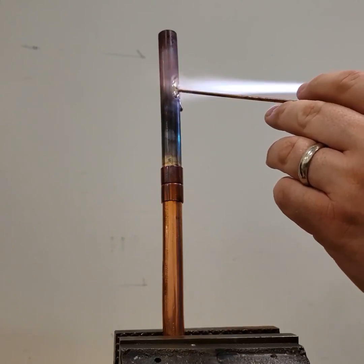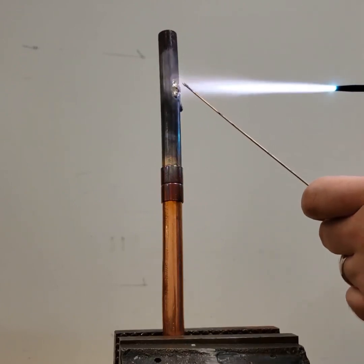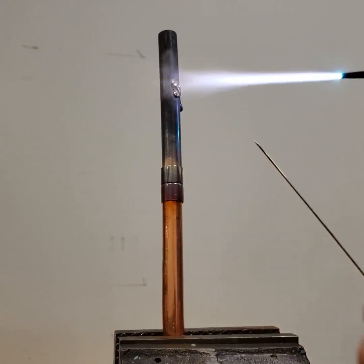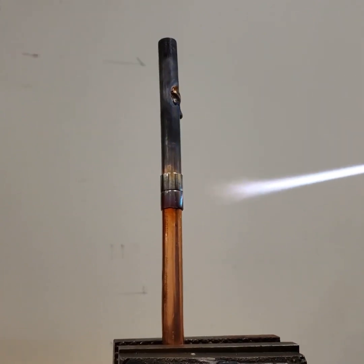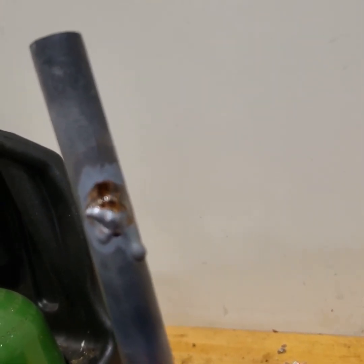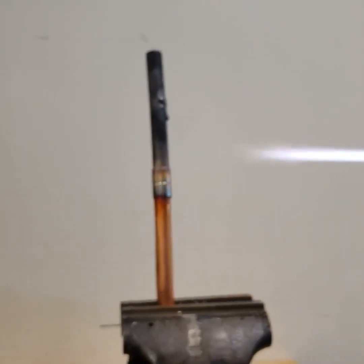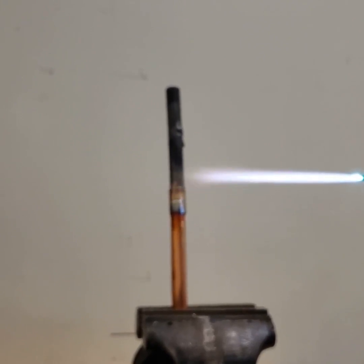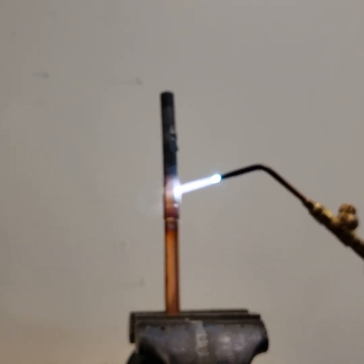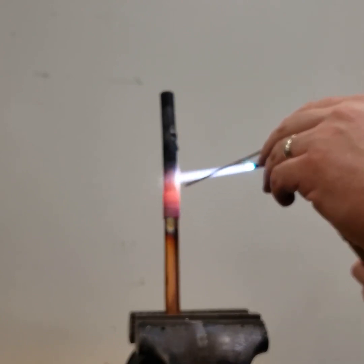It started to get a little warmer than I needed, so I'm moving the torch away. I'm trying to get right at the temperature where the braze will melt. When you were soldering you probably found it was difficult to fill large holes with solder; braze on the other hand can actually fill larger holes. You'll notice the metal is discoloring because of the temperature we're getting up to. I'm warming it up, looking for that nice orange color on both the pipe and the fitting.